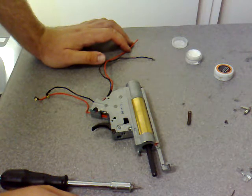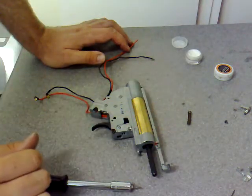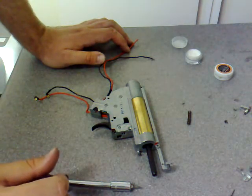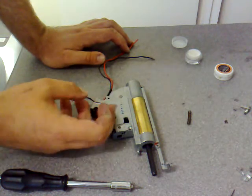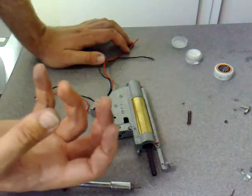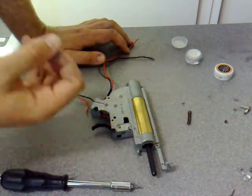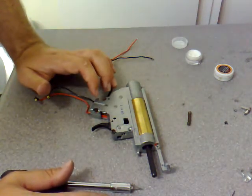We've gone over the principles of fitting bearings or bushings. For the final thing, when you know you've got everything just nice and right, get some bearing lock, which is basically like a loctite but about two strengths up. It's so hard that it'll hold the bearings or bushings in place around the outside, so that when the gears spin they don't potentially spin the bearings or bushings. If bearings are spinning, you're basically defeating the whole point of having bearings. With bushings, you don't want them spinning either, as that potentially widens the hole, and eventually you'll get lateral movement, and eventually have to replace your gearbox or cause damage.